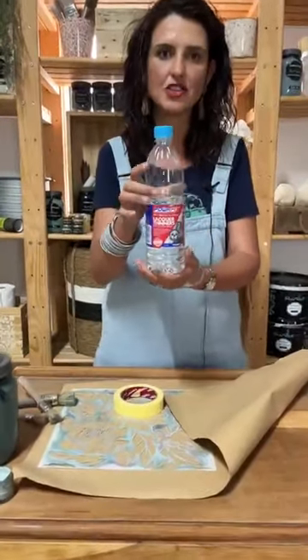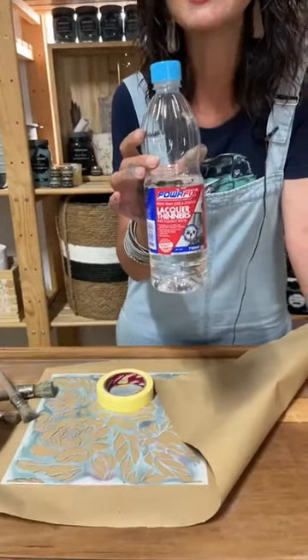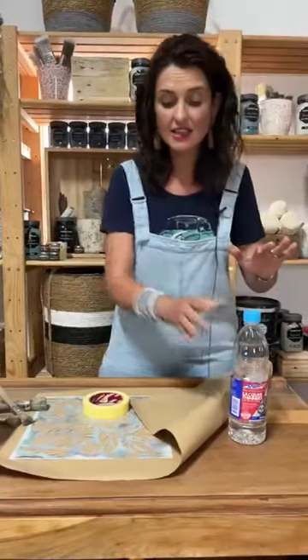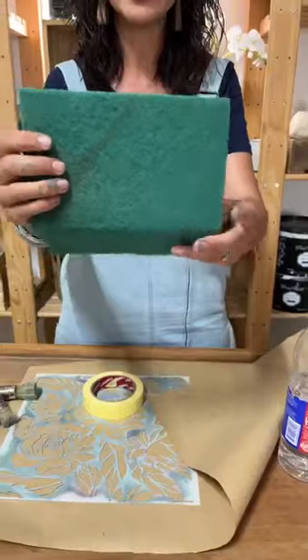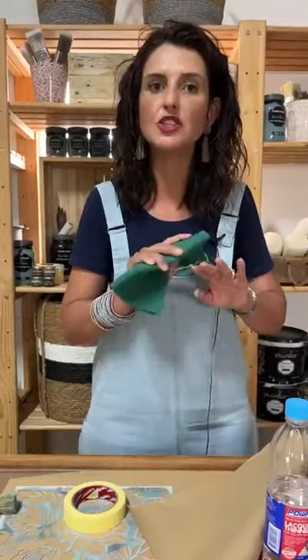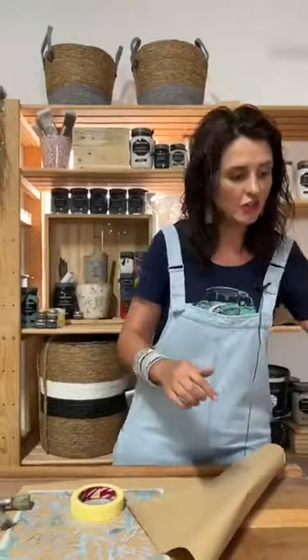If you're in a different country, just test and make sure the thinners you use actually works. Don't use benzene, sugar soap, or turpentine. What the thinners does is it etches the surface and removes any oiliness or greasiness so that your paint can adhere. I've used a scotch pad — the coarse side of a kitchen sponge — soaked in thinners. I've worn gloves and made sure there's enough ventilation, then scrubbed down this piece on the areas where I don't want to sand but do want to paint. Especially on an oily piece like this with numerous coats of furniture polish.